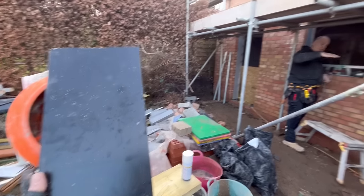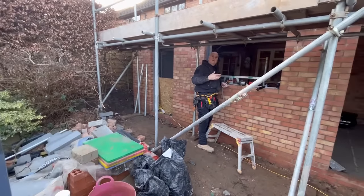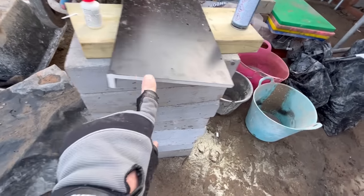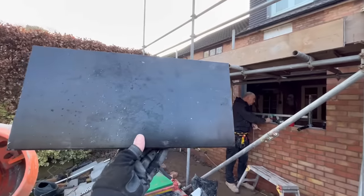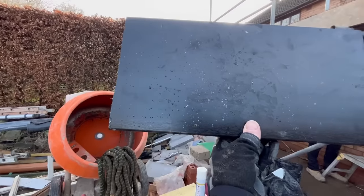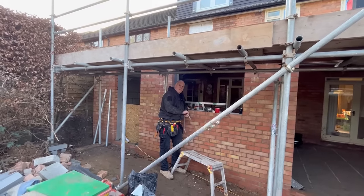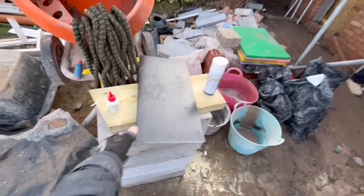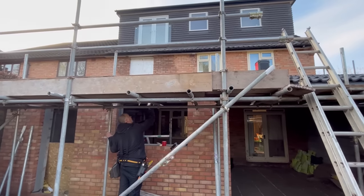They'll normally cut you a metre off because it's such a big piece, rather than buying the whole board. It's like a double-ended board - about 600mm wide, or up to 750mm for those box ends. It's a piece of this board that's continuous, with a double end on it, which means you can trim it to suit your box by doing that. Because this is such a small barge and small fascia, we can use a piece of this off-cut. We're going to crack on and put the fascia on, and then we'll show you how we join everything.